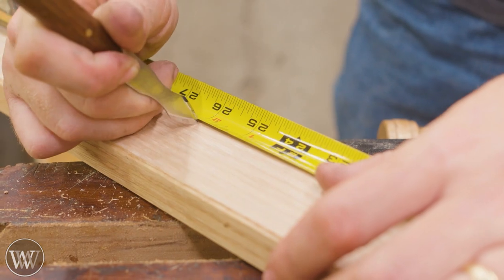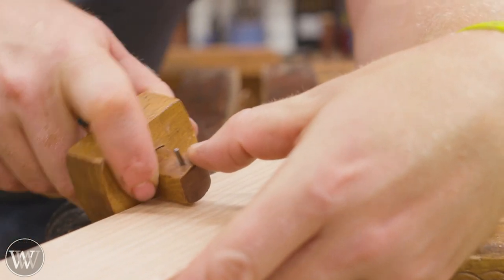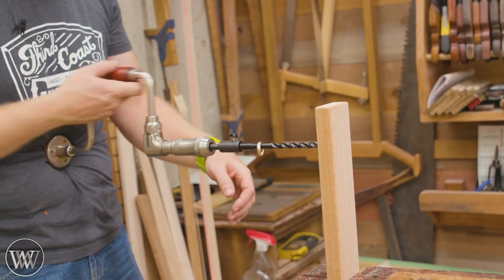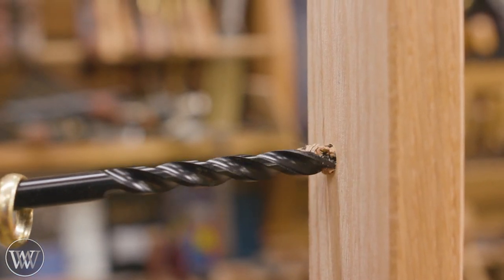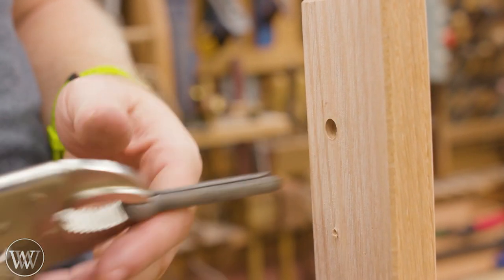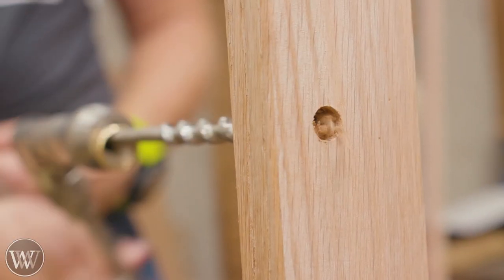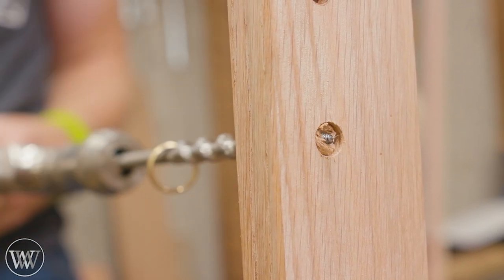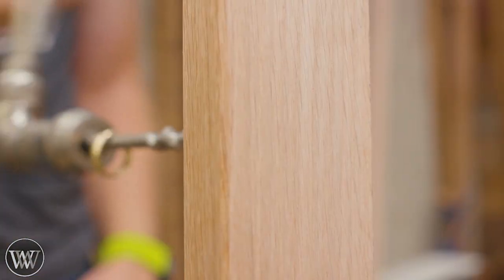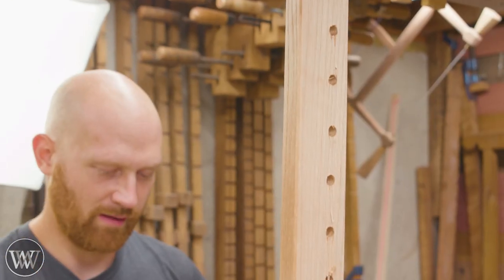I marked them all out — the screw moved about two and a half inches, so the holes are spaced accordingly. To figure out the depth, you can put the bracket on there and mark the hole, then put a ring on the bit so you know how deep to go. After that first hole I found the spade bit was a bit too tight — really crimping in there — so I came in with a twist bit. I ended up going a full size larger than needed, but as long as the pin goes through, that's what really matters. I ended up drilling all the holes a full size larger, and I could see I was blowing out the backside rather than keeping them clean.